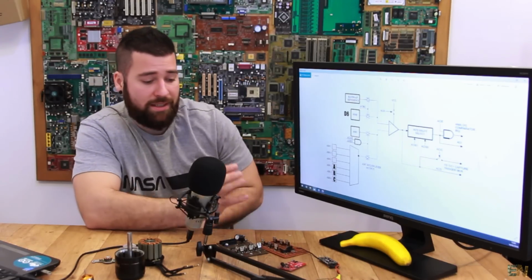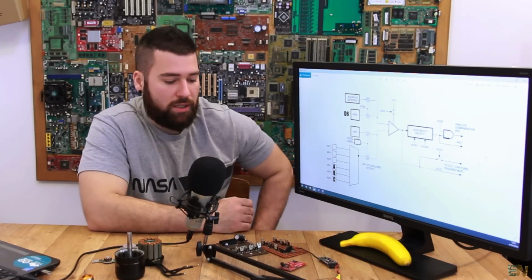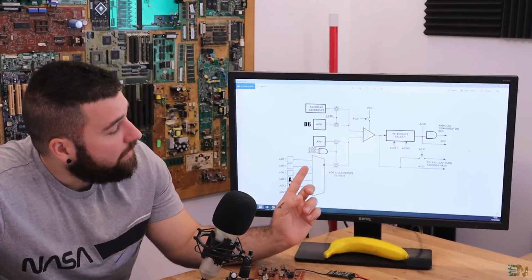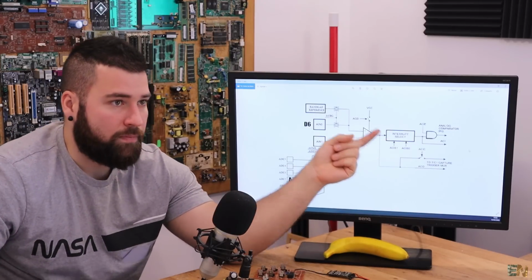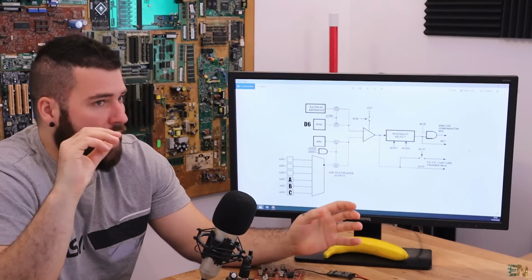And the best of all is that this is already inside of the microcontroller, so we don't have to use extra space on the PCB. And it's very easy to control it. All we have to do is change some registers. And each time the output of this comparator goes from 0 to 1 or from 1 to 0, it will enable an interruption, an ISR. And we go into the vector of that interruption in the code, and we make the switch.